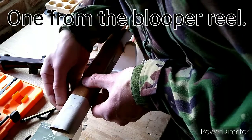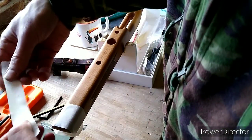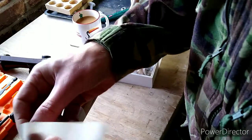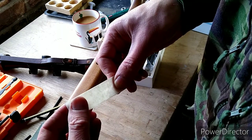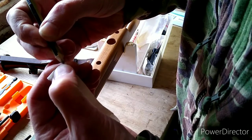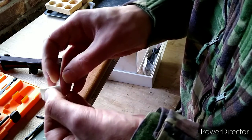Fold the edge of the tape and again — this side. Those two fold lines give you the exact circumference of your stock. Put those two pieces together like so — don't do it massively tight so you don't get your finger stuck in it. Fold it over, mark that fold line with your pencil, and that is your halfway point. Love working with masking tape.